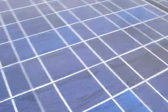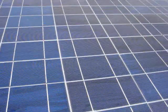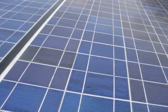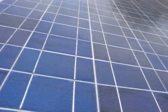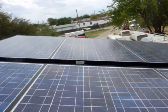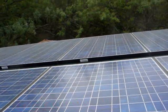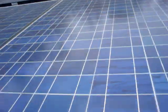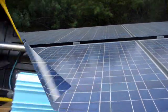Basically what you need to know is it's 205 watts each — over 4,000 watts of solar panel up here. The grid tie inverters are 1,200 watts each and I have four of them: one for that set, one for that set, one for that set, and one for that set. I'm running each panel to the grid tie inverter on 12 gauge wire, and each connection is separate.